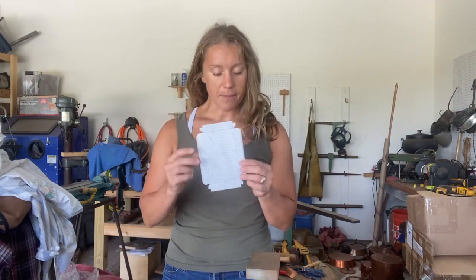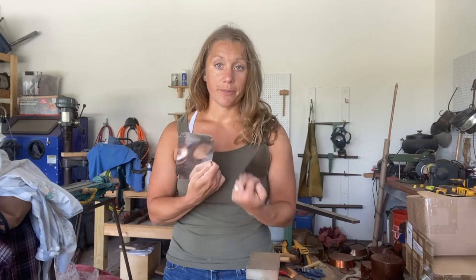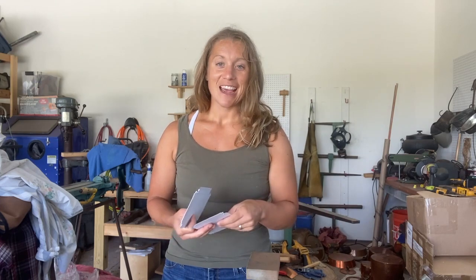It's one of those pieces you can make using only a handful of tools, all of which were available in the 1700s through today. First and foremost, when we do a pattern like this, we create your dimensions. This is a 3 by 5 inch box. I've pasted the bottom and top patterns onto scrap tin — any kind of sheet metal or sheet steel. You glue the paper pattern onto your steel or tin, cut it out, and you have an ongoing pattern. Paper is not your friend when tracing on sheet metal, so this makes it a lot easier. The biggest part is getting your corners right.